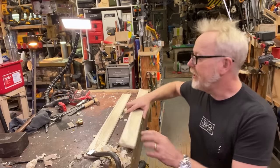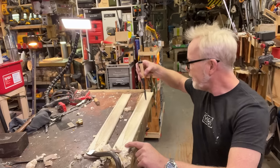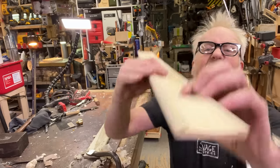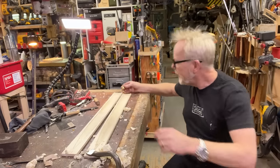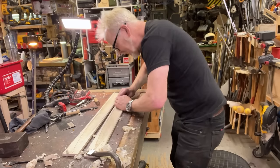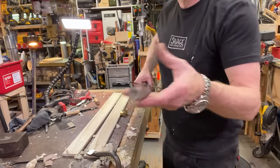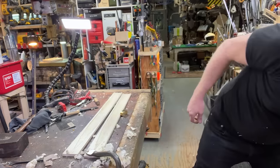And then I used a chisel and outlined with the flat side out. I outlined that about an eighth of an inch down, and then I chiseled down a little ledge right there. And now I'm going in with the violin plane, and I am bowling. I am creating the bowl that will handle the sort of diamond cross section of the blade. That's the bowl.